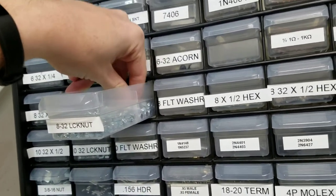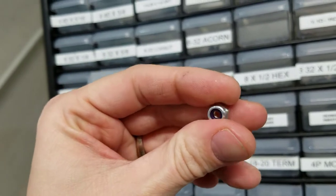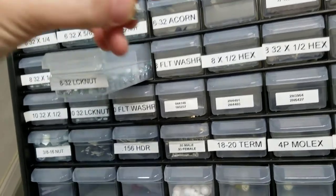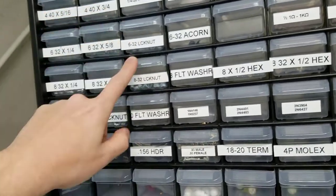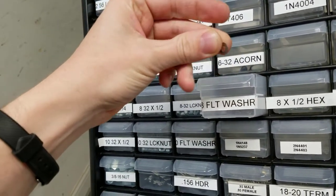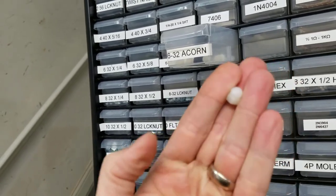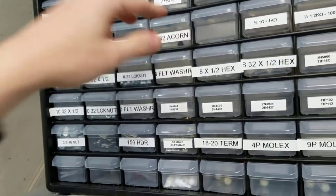There are two different styles of lock nuts to buy. The first are nylon lock nuts — you'll always find these when taking apart a pinball machine. You also find ones with built-in lock washers. I try to always replace one-to-one on that. You also want flat washers — a box of size 8 flat washers is always great to have. For early solid state, there are acorn nuts — McMaster-Carr sells these very cheap, in white and black depending on the machine.